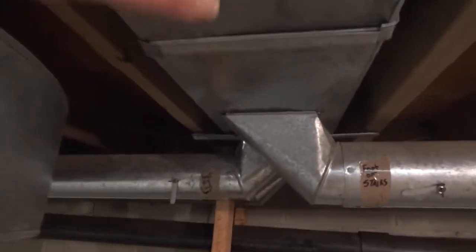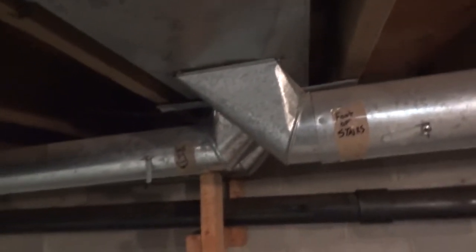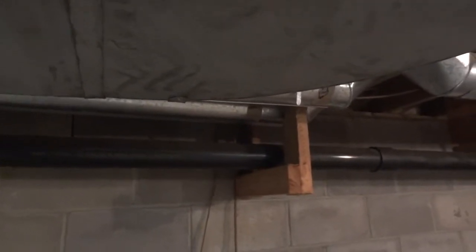But the silly part is this duct here, this is useful. This does feed everything nicely. And there is enough CFM, I'd imagine, with a higher rate blower, with a higher spinning CFM blower. So here's the other side, and it did the same thing at 45, exactly what I just showed you. Then we get to here, we 45 again. Then we go into a 90. Sure, why not? Why not add more feet to the duct and more static pressure? Is that's the word I was looking for, static pressure. This system is a static duct pressure screw up, whatever you want to call it.